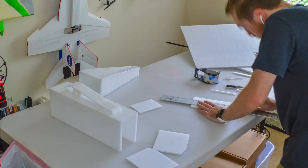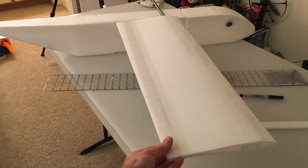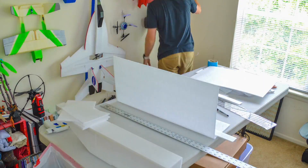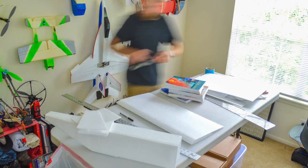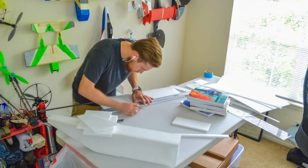It has a four inch wide by six inch tall fuselage with an overall length in the fuselage of about 40 inches and a wingspan of about six feet. So it's a pretty big airplane. And the reason why I did this is because I wanted it to fly more like a full size airplane and behave a little bit better in air than a smaller model would. The size of this plane also means that it'll be easier to observe changes in flight performance, and there will be more space inside the fuselage for modifications in the future.